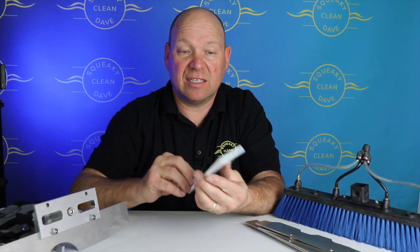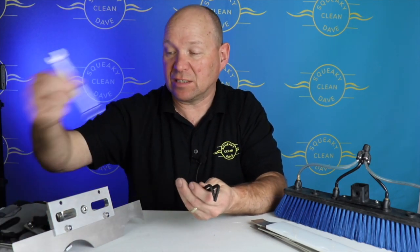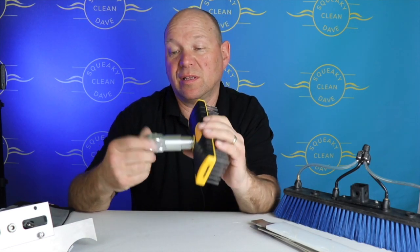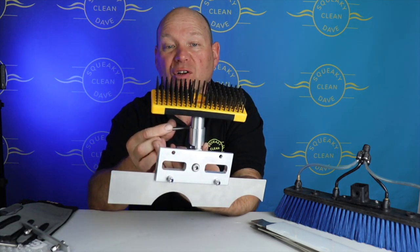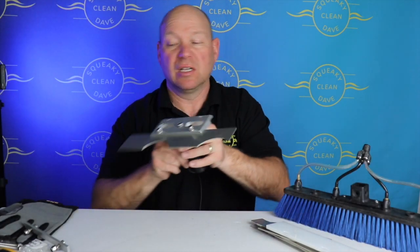The set also comes with polythene or some sort of plastic for doing slate. It comes with allen keys and a spanner so you can change the blades out and tighten them up really tight. You can also undo the allen key in the middle to change the angle on the gooseneck. There's also a wire brush with an adapter that allows you to put it onto the back of the gooseneck — you take the gooseneck apart, put the wire brush in the middle, and it comes with longer bolts so you can bolt right the way through and hold it all tight.